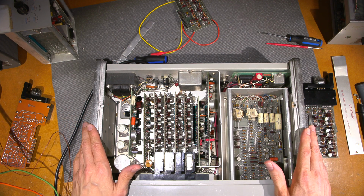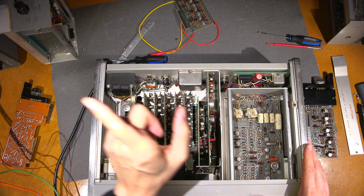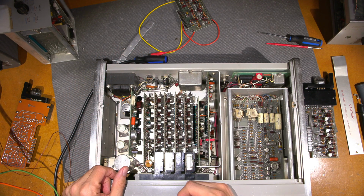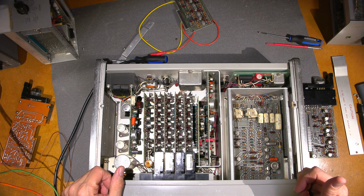A lot of people nowadays think that everything has to be working and up to temp and to spec within 2 minutes or the minute you turn it on. It's not like that with any type of test equipment. My Fluke 5440B, that's right up here, which you'll see in a moment as I'm moving the numbers around here, you'll see that thing has to warm up for half an hour, or if you run a self-diagnostic on it, it'll give you all sorts of horrible errors. And there's a lot of circuitry in there.